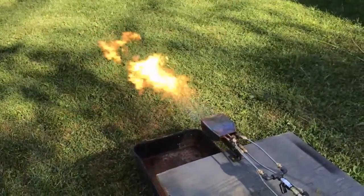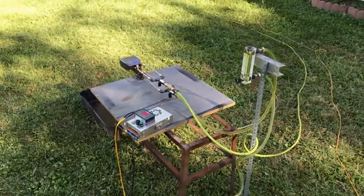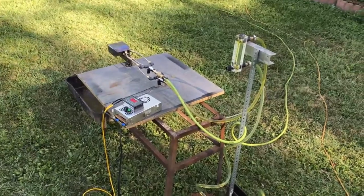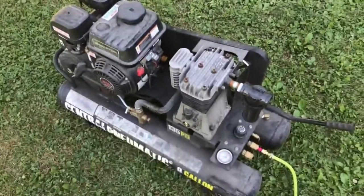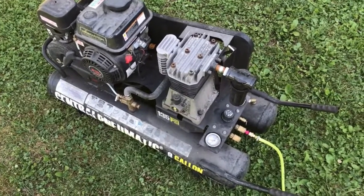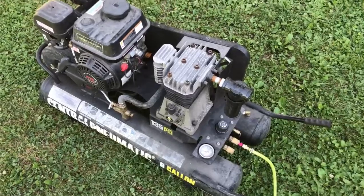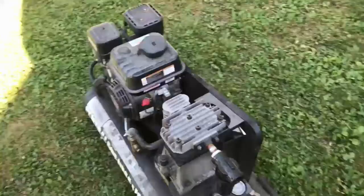As I said, we can't read the rotometer with waste oil. That was just a quick look at what 40 liters an hour looks like, or 400 kilowatts. This air compressor was running at full capacity and was only able to achieve a back pressure of about 75 PSI, but that's kind of misleading because a lot of the horsepower of this engine is being wasted due to the gear ratio used to drive the pump.